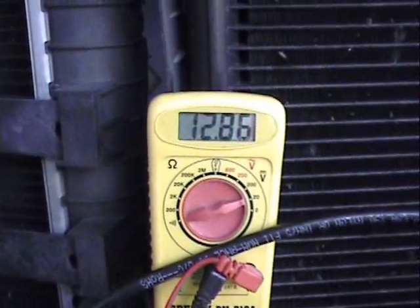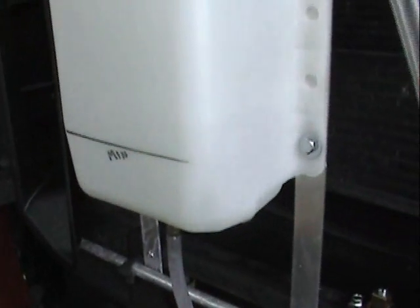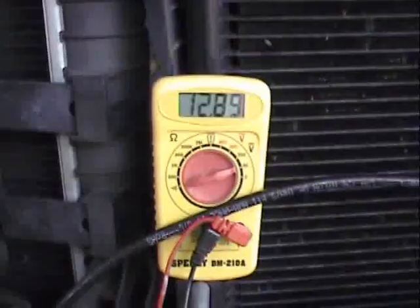Okay, I'm back now with the engine running — 12.86 to 12.87 volts, 55.9 amps. Just to show you my production and outflow — things are pumping pretty good, bubbling. I don't have a full reservoir right now; I'm playing with my electrolytes. Now we're going to go ahead and hook this tube up one more time, hit my stopwatch, and we're off. Okay — bubbles are coming out at 18 seconds. 18 seconds for one liter.